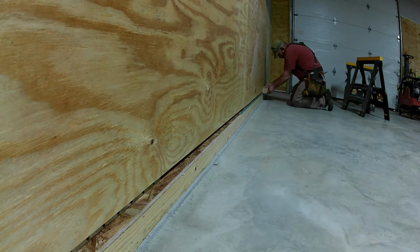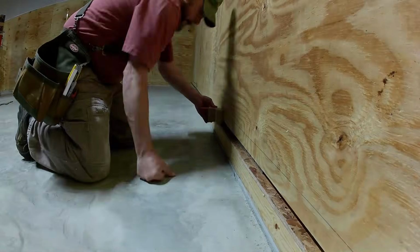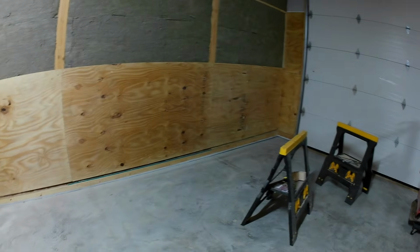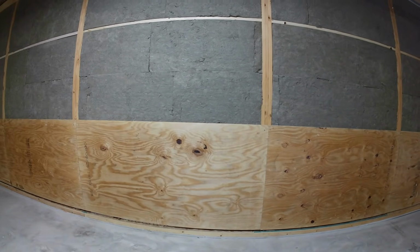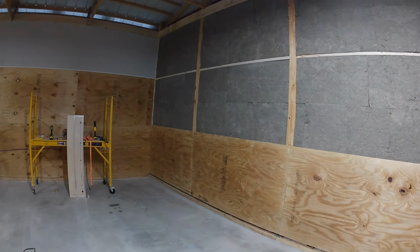Now that that's done, we can take the panels off, cut on that scribe mark, and then reinstall those panels. And then course number 1 will be done. Then we just go in here, we drop in the second one. It's a little bit easier because if we're starting with a straight line, we don't have to do the extra step. We measure width, cut length, tongue and groove, and install them.